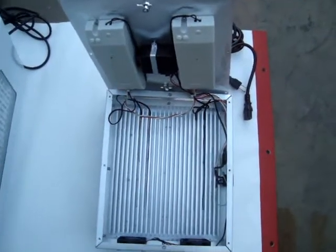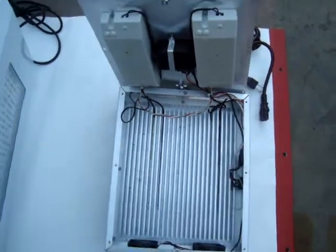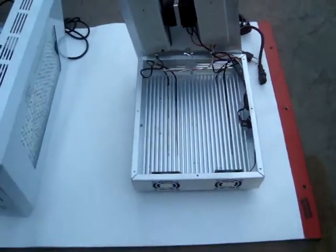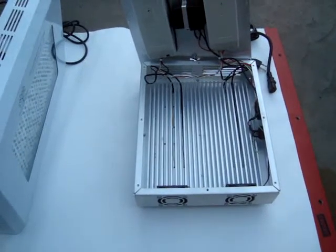When we come over to the Apache Tech AT120, we see that it has 2 heavy duty class 2 UL listed power supplies, 1 fan power supply, 2 fans, and best of all, this heavy duty extruded aluminum heatsink. Also worth noting is the pass-through fan action.